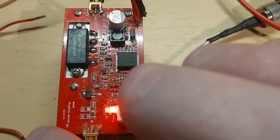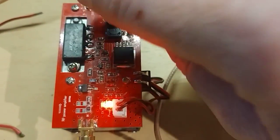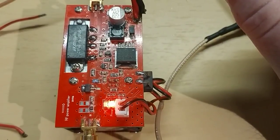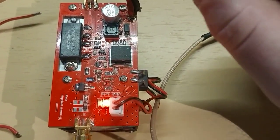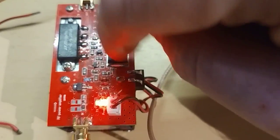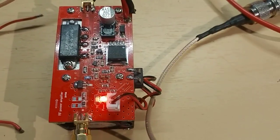All you got to do is connect the antenna center pin to center pin and bypass this amp when you are receiving. That's all you have to do. And then when the open spot goes into transmit, it would kick the relay, bypass that, and everything would transmit through the amplifier. Simple circuit.